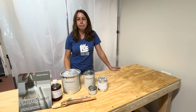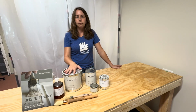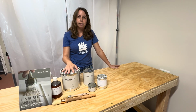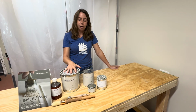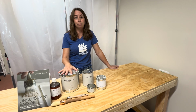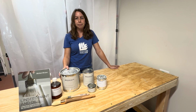Very cool. And the paint that we're often scraping back was a leaded paint used primarily in the teens, 20s, and 30s of the 1900s. So, when people think of linseed oil paint in historic houses, they worry about lead. That was because they used to add lead as a hardening factor. It also helped with mold and mildew. Now, in modern day linseed paints, that's replaced with something called zinc oxide, which has about 85% of the same result, which I think is a remarkable success considering what it can do as far as keeping that mold and mildew down. Yeah, especially if you're in a southern climate, that's very helpful.